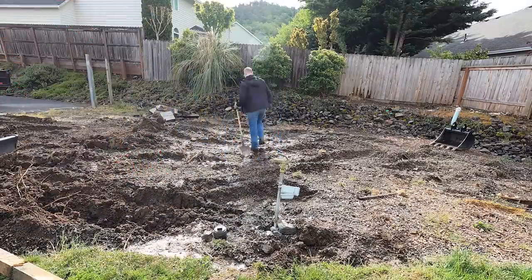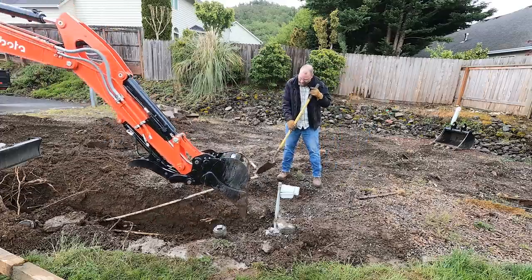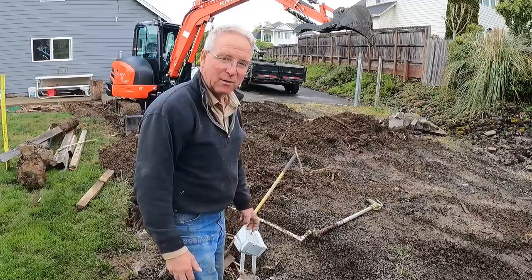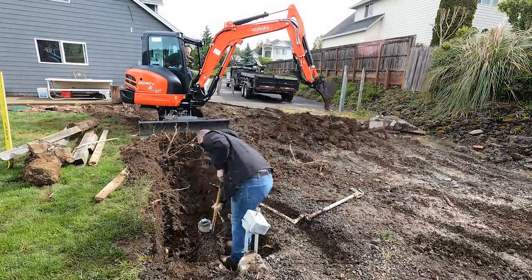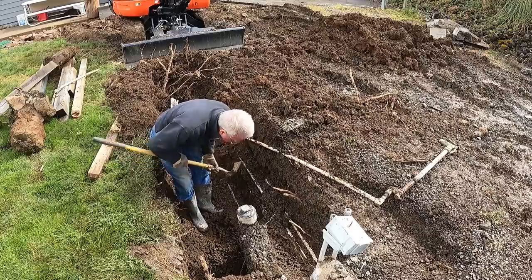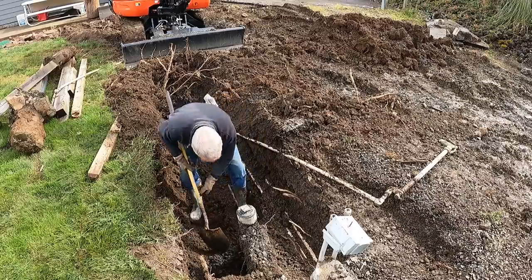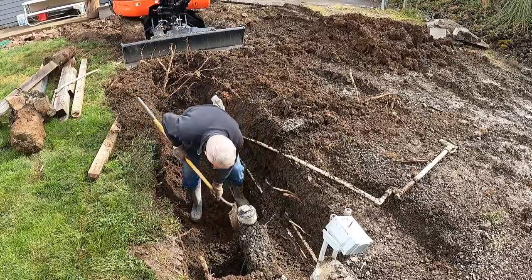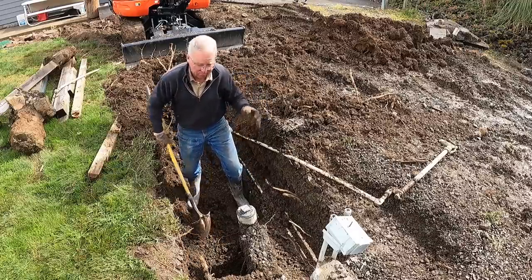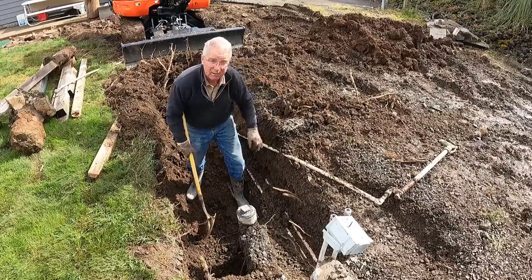I'm really no good at all at underground forensics. We have some extra water lines and we haven't really uncovered where the conduit goes or comes from. The sewer line continues to go deeper so we're going to follow that carefully and see what happens. This is a classic example of starfish construction - you don't know where you're at, you don't know where you're going, but you're still moving and sometimes that's the best we got. We've got electrical conduit shaping up right here, water pipes above that, and then we've got into a little extra gravel here, which is probably the way they backfilled around this sewer line. I broke the sounding wire right off the bat, but here it is again. We're going to do a little bit of hand work so we don't do any more damage than we have to, and I think we're just about to know what we have to tie into when we start putting up the batter boards and sighting the building.